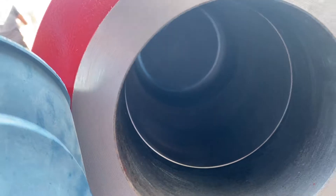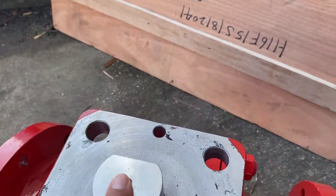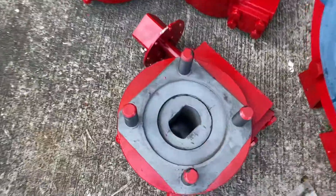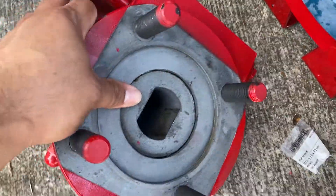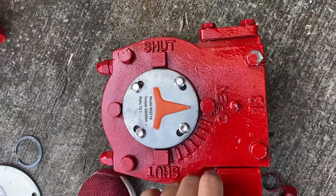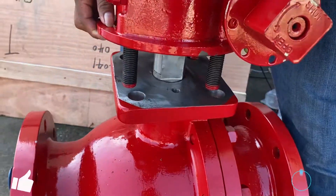So now we're going to look inside of the valve. The valve is in the open position. We can see the stem position is like this. We want to make sure it matches the gear and that the gear is in the open position. So now we're going to take the gear and slide it on top of the stem.